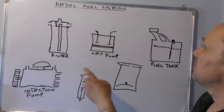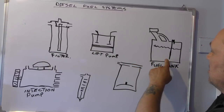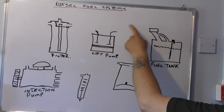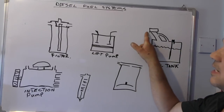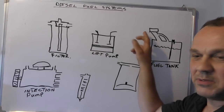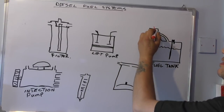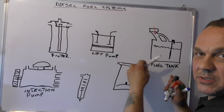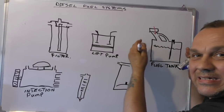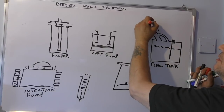So let's start off. What we have is a fuel tank up here — a reservoir to keep your fuel in. You have a pipe which you can suck the diesel out of. You also have a tank cap, and this is really important because people sometimes forget this: the tank cap is actually vented. You'll have a valve in here — when the diesel's sucked out it compensates and lets pressure in so it doesn't collapse in on itself or stop the diesel from flowing.